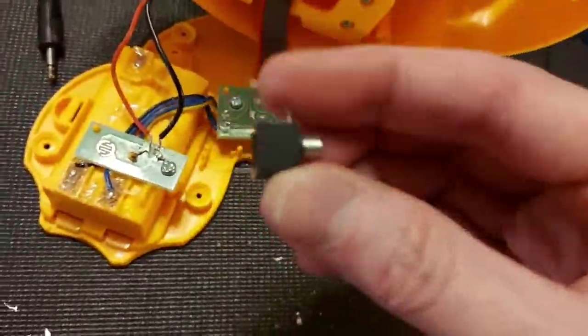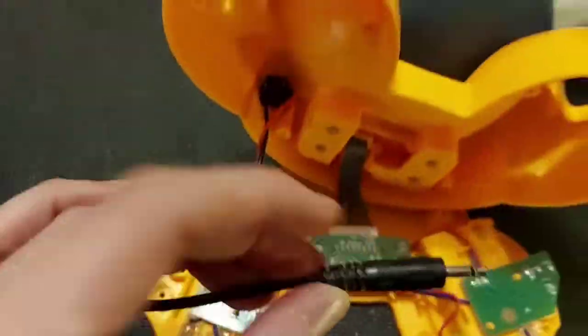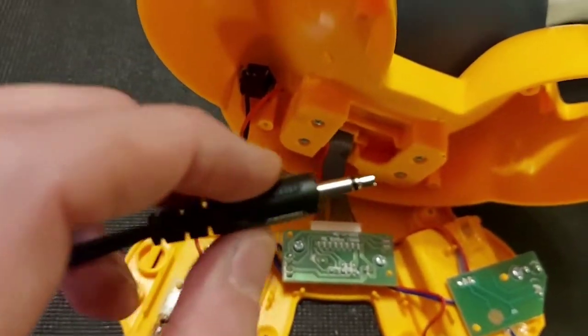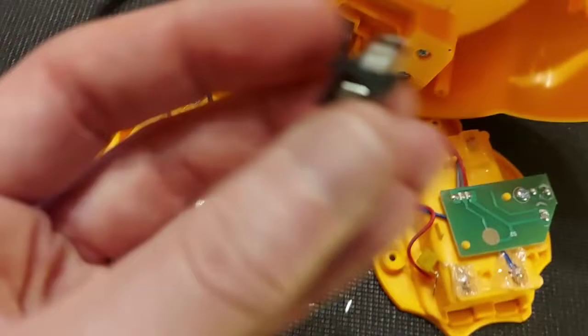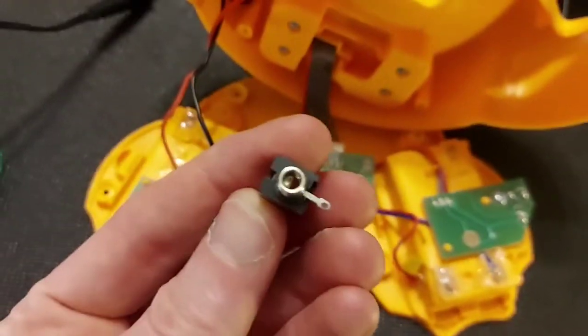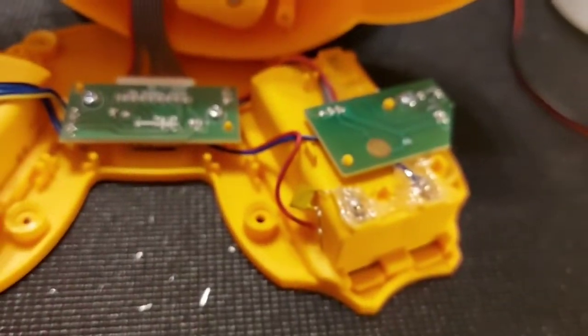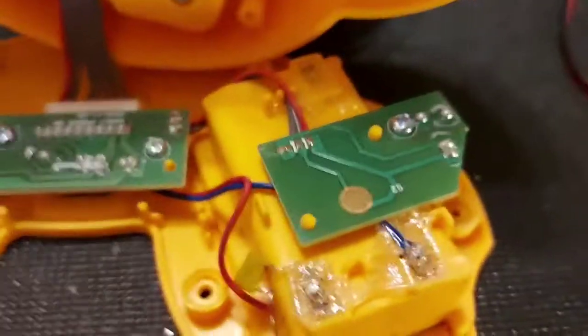I tend to use these ports. Some people will actually buy a corded wire that, instead of being the jack, is the plug — this is the jack side, this is the plug side. You can buy things like headphone extenders, cut the wires, and splice them into a piece that can be threaded in and soldered onto the same joints. I prefer not to go that way, especially with stereo ones, as it can get more complicated. If you can get a mono one it's much easier. But there are resources out there showing that approach too.